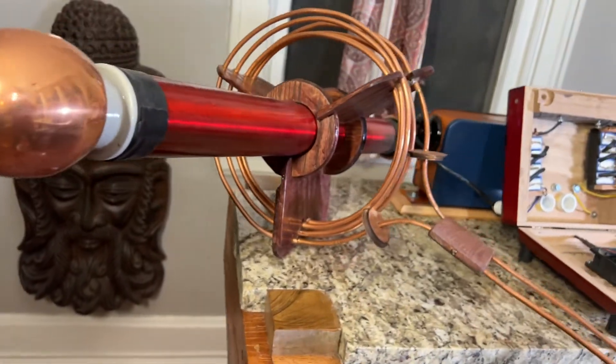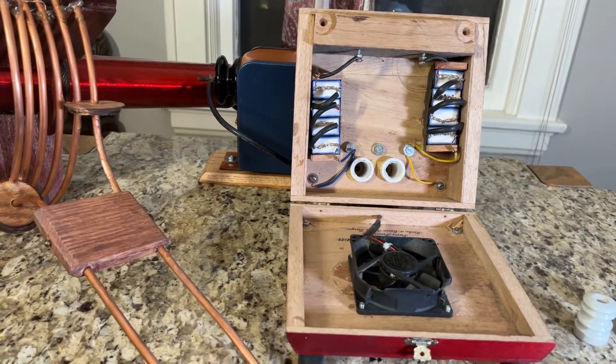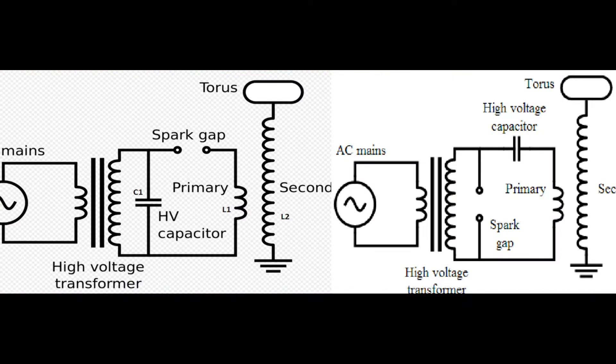I did use the recommended polystyrene foil type capacitors because they're cheap. Now, rule number six: when you look through basic coil designs, it appears that you're going to have to choose between one of two basic designs. This is kind of false, because if you realize that coiled refrigerator tube is basically no resistance at all — basically a short circuit for 50 or 60 cycle current — the two circuits are electrically identical.